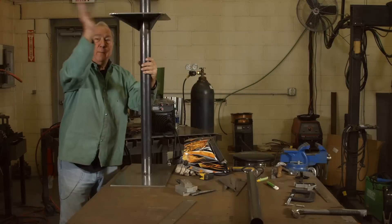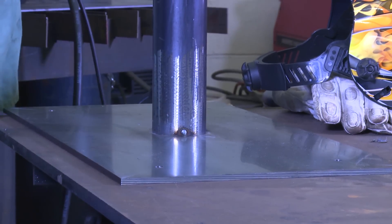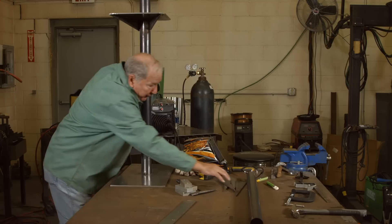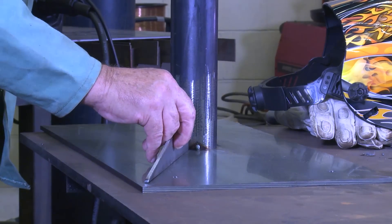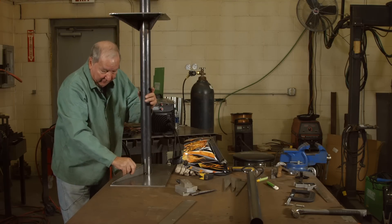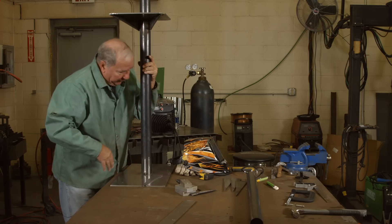Alright, we've got the table welded on. I now have it placed on my base plate and I've tacked it down so it'll stay in place. You have to make sure that it's square and everything, which we did. Now what I'm going to do before I continue to weld all the way around — I had cut gussets, or stiffeners, that are going to go on here like so. Rather than weld all the way around and then have to notch out the end of my gusset to go over the weld at the base, I'm just going to put these on first and then weld between them to secure it to the base.